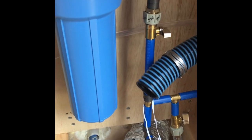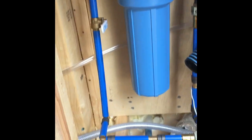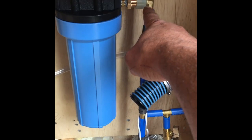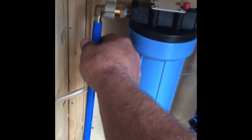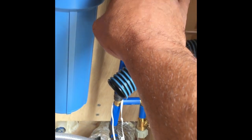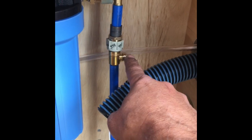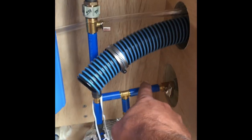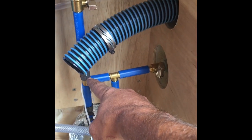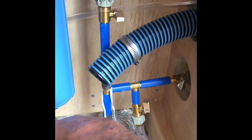Let me crimp some of this up and then hook up some water and see how many leaks we've got. Here's my water filter — this is the inside and this is coming out. If I ever want to not utilize this filter, I just shut this valve, which is shut right now, and then the water coming in will bypass that and go down and supply the trailer.